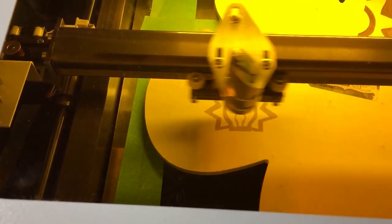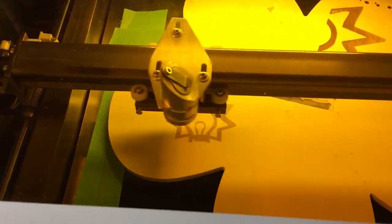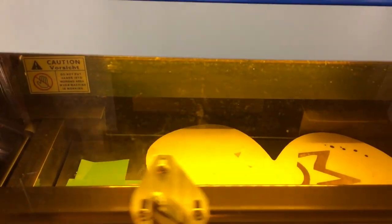This is one other area of the cutter that has to be addressed. The airflow from the back side was solved, but the problem is the front grates are still too small — they don't allow enough airflow into the laser cutter. To get more airflow I've propped the front open. Later I replaced that screwdriver with just a couple of furniture standoffs from the dollar store just to hold the lid open a little bit. Worked perfectly.